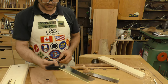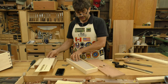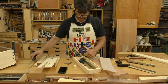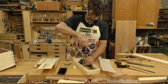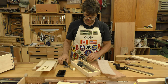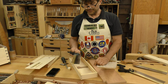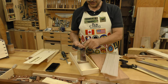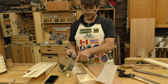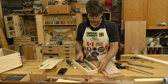Now, that's my saw — it has a gaboon ebony handle. This is our standard model; we use a composite handle that we make right here, and it comes in a box that we make here in the shop. This saw weighs, I think, 23 ounces, so it's fairly heavy — one thing people comment on right away. The composite handle is nice and heavy and durable. The brass back is seven-eighths of an inch wide, so it's got lots of weight, gives you all the downward pressure that you need, fits your hand nicely. And you'll always notice when you get them, they've got sawdust on the teeth, because after I make them, I test each one before we ship it out.